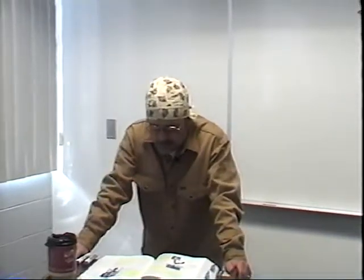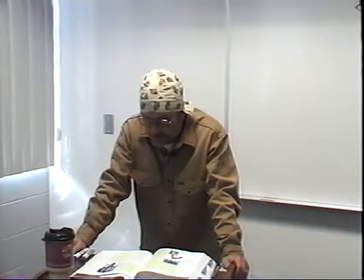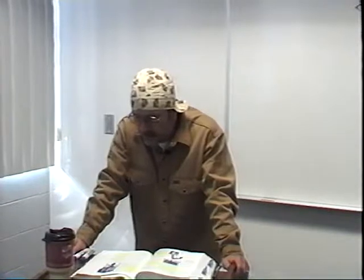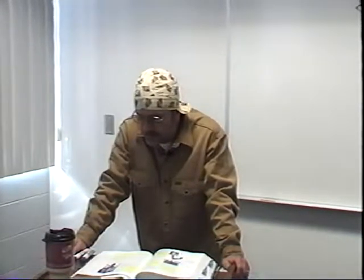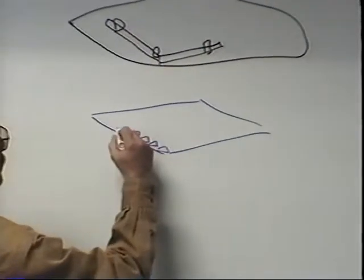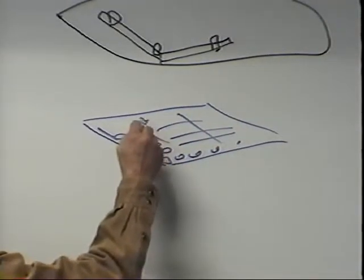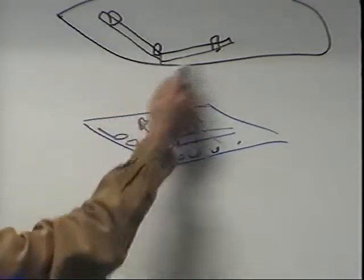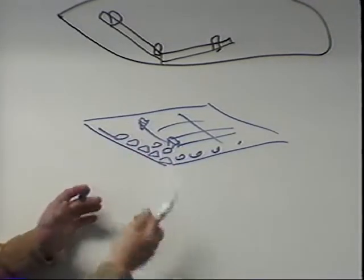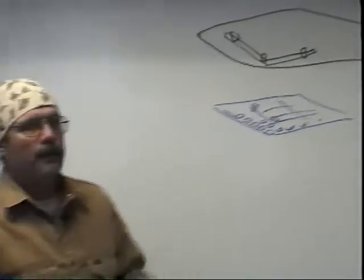Modular tooling uses platens, locators, bracing, and various clamping devices, which offer much greater flexibility than custom-built fixtures intended for a single weldment. The platen has a precision hole pattern allowing the location of various devices. This type of product is accurate, rigid, and easy to set up. The table in the welding lab next to our coordinate shape cutter is a platen — it's a table with square holes in it. You drop a pin into holes wherever you want, put your parts in, and when done, tap them out and rearrange them.